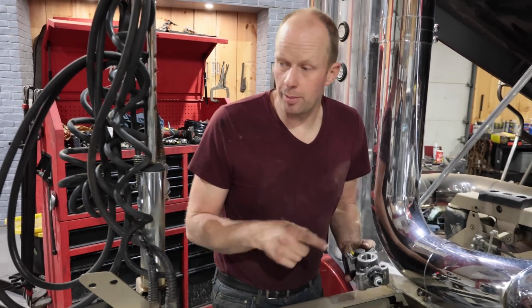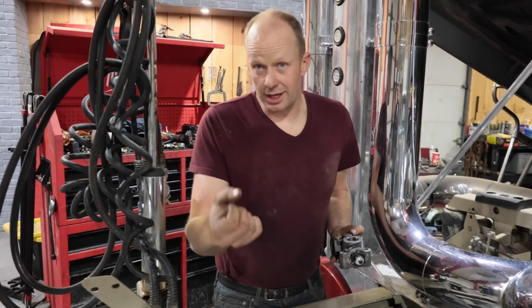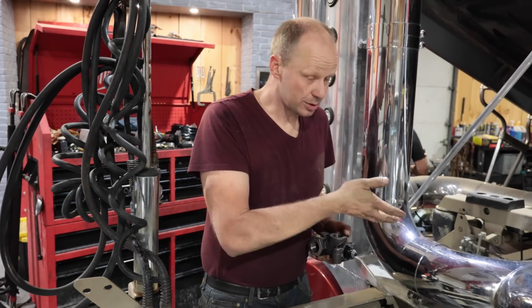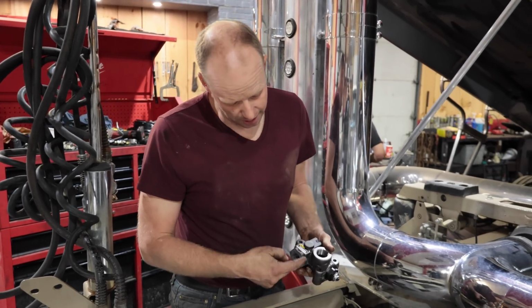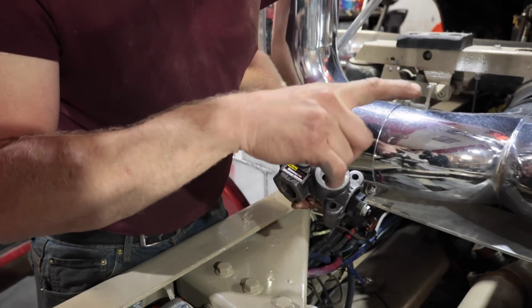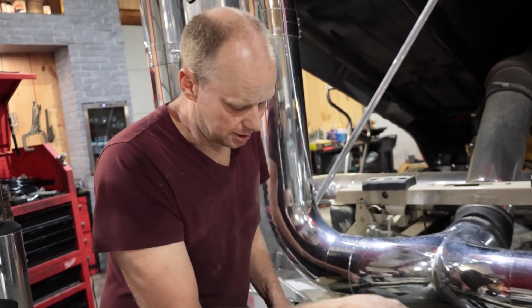Problem is, if you turn the pump on and you do not have your hoses connected to your trailer, or one isn't connected all the way, say you think you popped in your one hose, but it didn't actually connect and it didn't release the ball in the quick connect, your pump is gonna make pressure, it's gotta go somewhere. So what that will do is it'll shuttle this thing over, and then this will go to return. So we'll plumb this so it goes back into the tank.